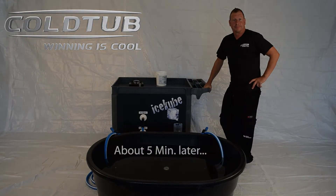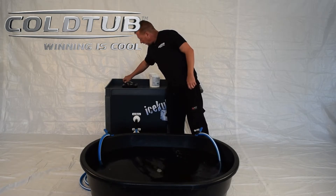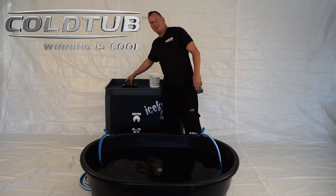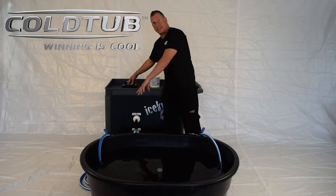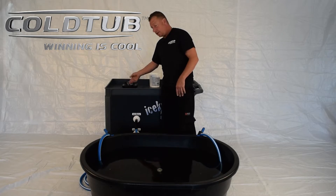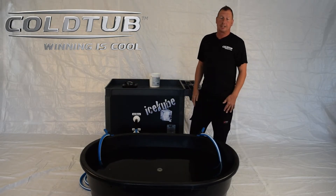Now we wait. Got some hiss. Water's going to come out — we'll close off that bleed valve. Then we can come down here and we've got the water running. Waiting for the water to start to come through. To wait five minutes is not uncommon, especially on the first couple times you do the hookup. If the hoses are completely dry and the pump has never been primed, five minutes is not uncommon. If you wait five to ten minutes and you've not had any water come through, you can turn the power off, open this up again, dump another half gallon to a gallon of water down there, close it up, fire it up again, and for sure it's going to work for you.